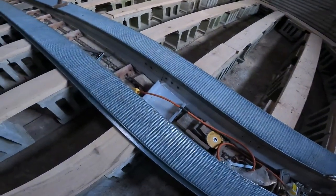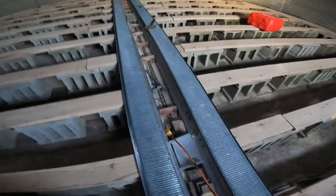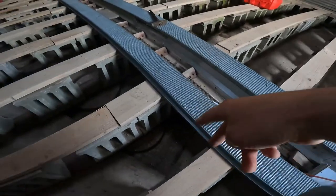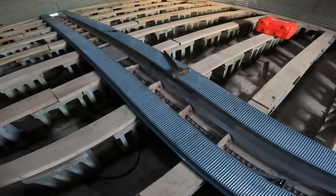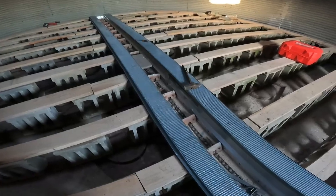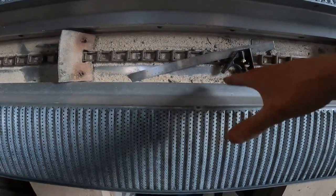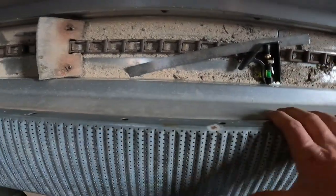Well, polka dots. Now, okay, so we see there's a small block on top of the block. That's to support the floor plank. And then, if you see, there's a screw. And I went down and put a sheet metal screw, we'll say on average every foot underneath. Pretty much two per gap here, and there's 16 inches in the gaps, so if I spaced them, they're roughly a foot. I had to support the floor, or anchor the floor to the elevator, so that it never moved. Don't want corn to ever get through that gap.